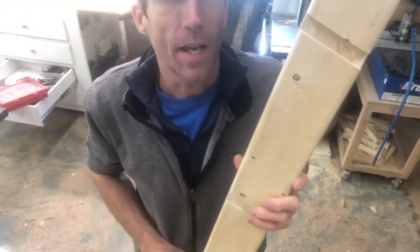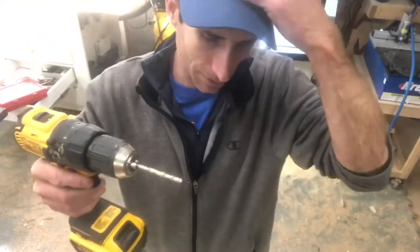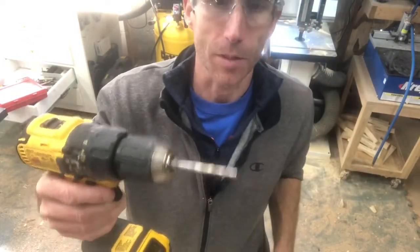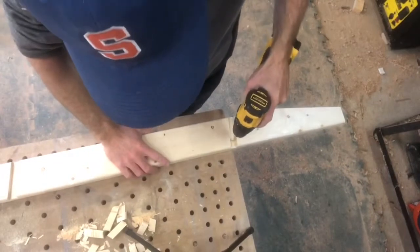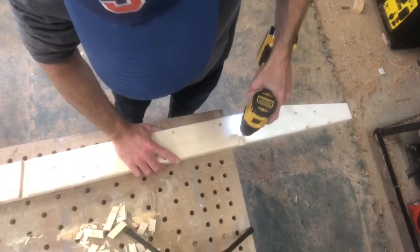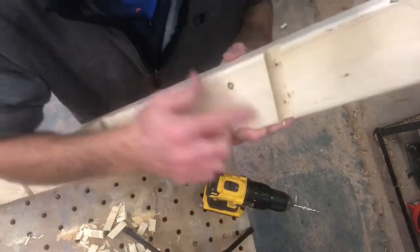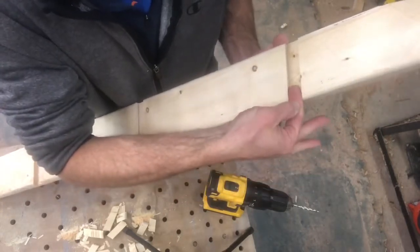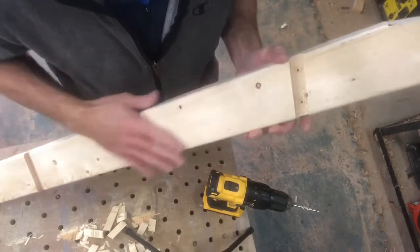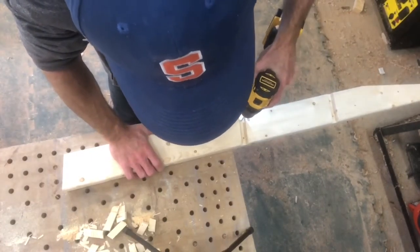After these slots are in on both boards, we're going to drill a pilot hole through here. A twist drill bit, probably around 3/16 of an inch — the diameter isn't super important, it could be a little bigger or smaller, just don't want it bigger than the head of the screw. I'm going to line it up in the middle, about an inch in from each side, centered. I'm trying to hold the drill nice and straight — that'll be the hardest part really.